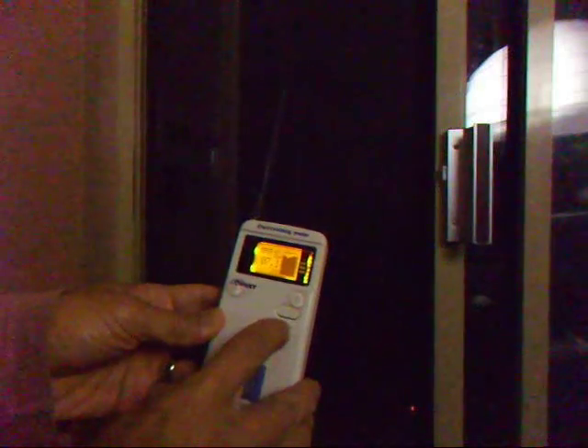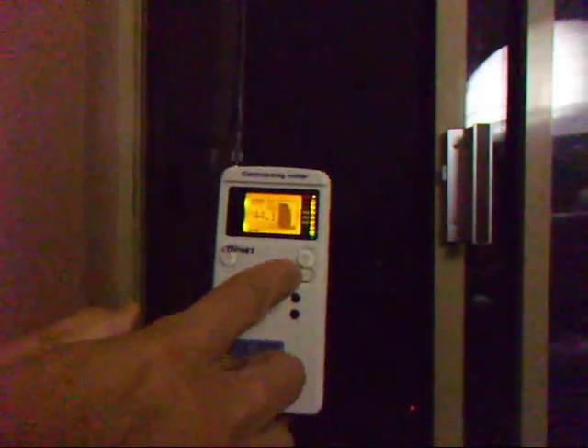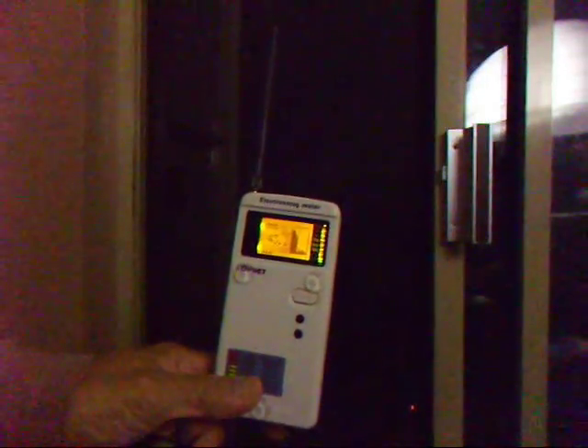The radiation chart is still elevated. Let's turn that back on and take the hold off. Minus 7 dBm. Now we're going to shut off the shotgun — shut it off. See the time-based chart; it's now dropped and we're back to minus 43 dBm. It's all green on the Cornet meter.